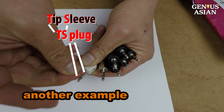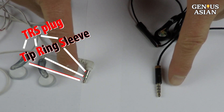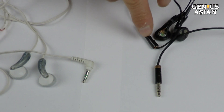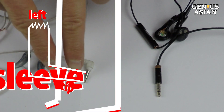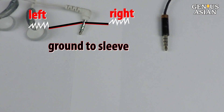If you have only one device connected to a TS plug, one wire connects to the tip and one to the sleeve — the device's load also acts as wire. But if you have a TRS plug connecting to stereo headphones, or a TRRS plug connecting to headphones and a mic, you may have difficulty detecting the broken spot. In stereo earbuds with TRS, the tip connects to the left earphone, the ring to the right earphone, and the sleeve to the ground. Often both ground wires from left and right earphones connect to a single terminal sleeve.